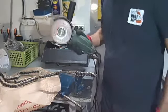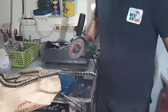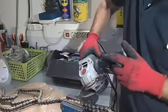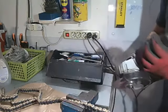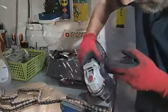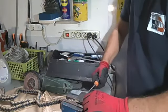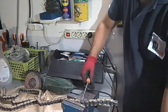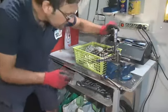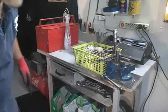Now we use this grinder, but we have not to cut actually the chain, because otherwise we should force the rivets outside. What is better is to buff the rivets going tangent. Now we try with the screwdriver, making a leverage to extract the joint. So finally we decided to use the tool, because it was not possible to extract the pin from the joint using the hammer. So the pin is forced through the joint.